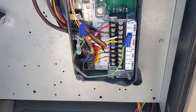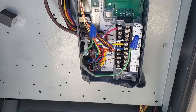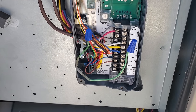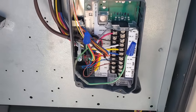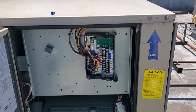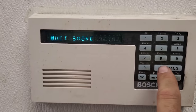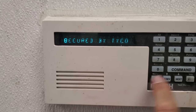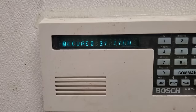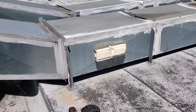So the end-of-line resistor is just there to prove the circuit. What I need to do now is get the manager involved, put the alarm back on, trigger it from downstairs, make sure we get an alarm condition, make sure it resets, and then call the fire alarm company and walk through all these steps with them — triggering a fire alarm condition and resetting it to make sure the circuit is all connected correctly and everything is good to go. This happened because I broke the circuit when I pulled that resistor out, so they got a trouble condition. We're going to silence it, reset it, and then call the alarm company.